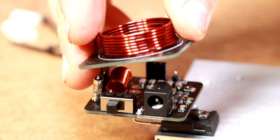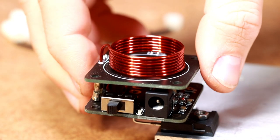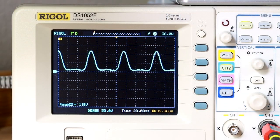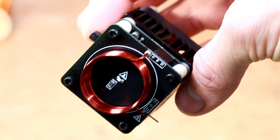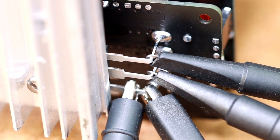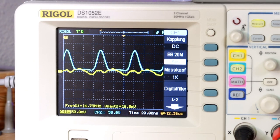I'm now reassembling everything so that we can do some tests. I'm really excited. The construction is the same, only that we use a new heatsink and a new MOSFET. At the same time I'm looking at the drain-source voltage so I know approximately when the limit of the MOSFET is reached. I think this module is very well tuned. Let's see if it runs in zero voltage switching mode. For this we measure the gate signal and in parallel the drain-source voltage — the MOSFET should switch whenever there's no current flowing in the oscillating circuit. That looks good.